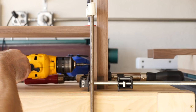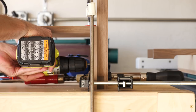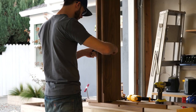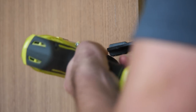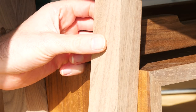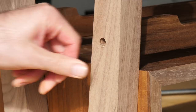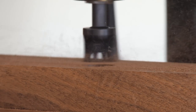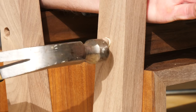So with all of my pieces complete, save for the drawer, I started assembling things. I started with the legs, which are attached directly to the case via a couple of screws on the inside — so you'll never see them unless you pull the drawer out. Once the legs were attached, I could install my case bras. I went with the simplest method: I attached the center point on the inside of the case just like I did with the legs, and then to attach them to the legs, I screwed through the leg and into the piece, which meant you could see a screw hole from the outside. To cover these, I drilled a recess using my 3/8-inch bit, then cut some tapered plugs out of scrap from the project. Because these come from offcuts of the same wood used for the legs, by the time you sand them — as long as you have the grain oriented the same way — they're nearly invisible from anything more than a couple feet away.